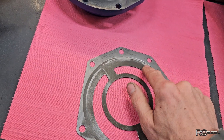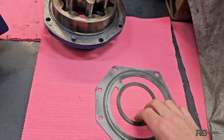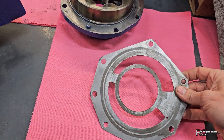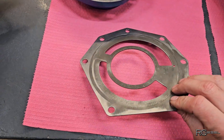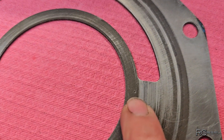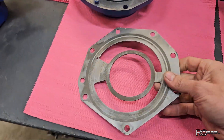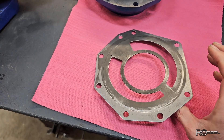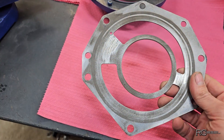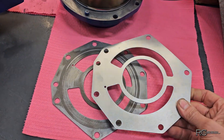This plate is just junk. We talked about putting it on a belt sander to smooth it out and take the high spots off. It would thin the plate out a little but at least we'd have something that worked. But by the time we smooth out both sides enough, we're going to have a piece of paper - so that's just not going to work. What we did was take it into the metal machine shop. They checked the hardness of this plate and as much as you'd think it would be stainless or some kind of tempered hardened steel, it's not - it's soft like butter, just mild steel.